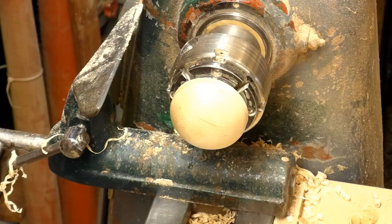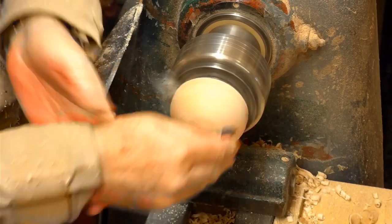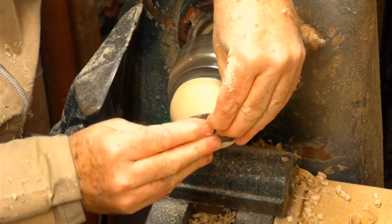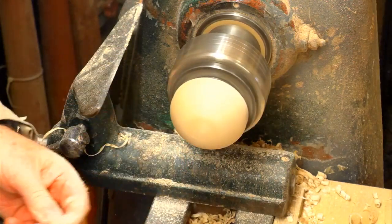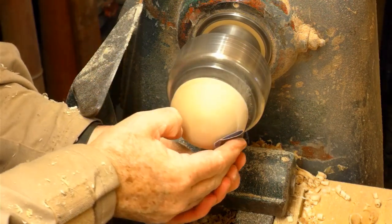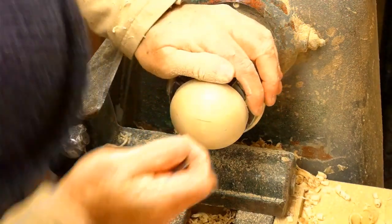And so what I will do is, with a bit of abrasive, we'll just come in, sand this to a nice finish, I should say, we've already shaped it. And then a slightly finer finish. Then we just stop and have a look before we apply any finish to it. That's quite nice. We can sand with the grain.